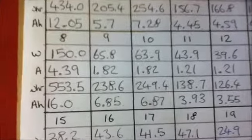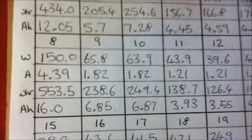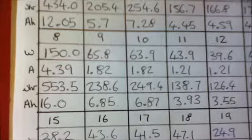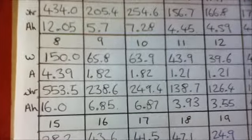Because I don't use the loads in the daytime when I'm at work, the batteries are usually well topped off and only need to draw a small current to be topped off. So if your figures look very low but your battery voltage is good, that would be the reason why.